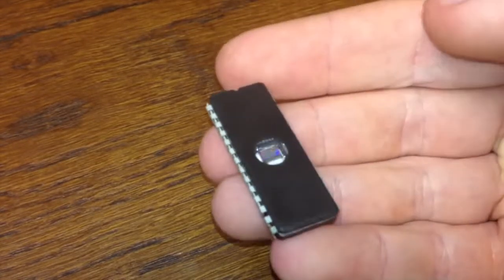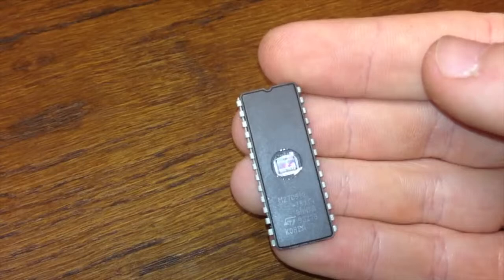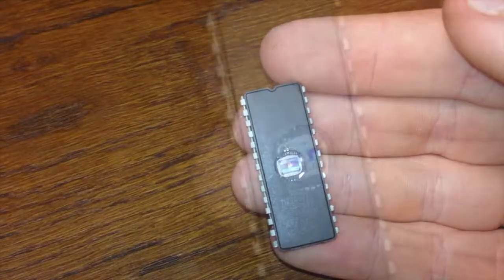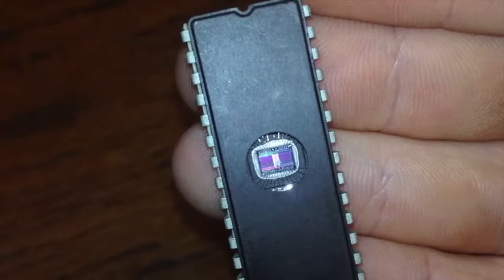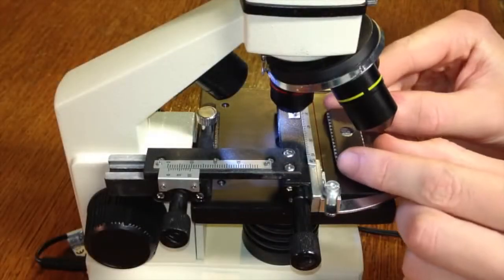And these chips serve to provide an operational code or firmware to a system. It's designed to be programmed once in manufacture and can be erased only by shining an ultraviolet light onto the silicon through this quartz glass window. And you can see that window, rather conveniently, allows us to very easily see inside and get a look at the surface layer of the silicon. So let's have a look at it under an optical microscope.